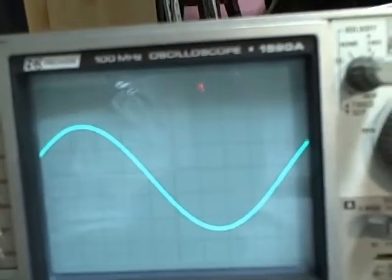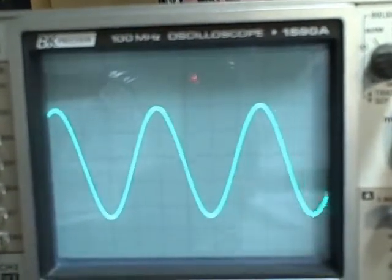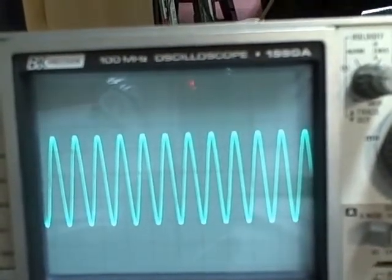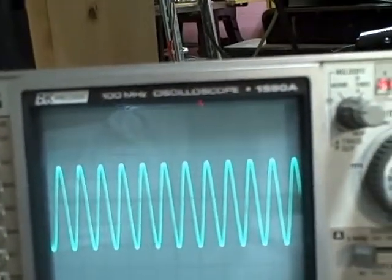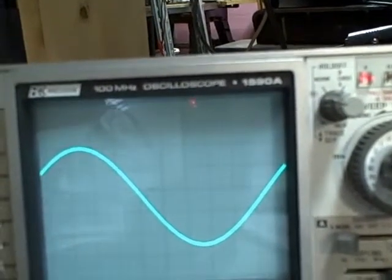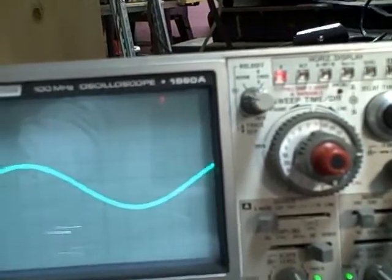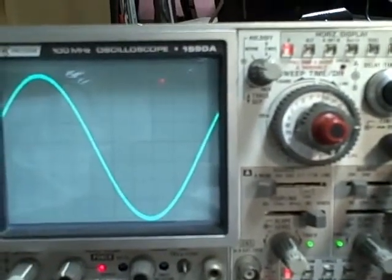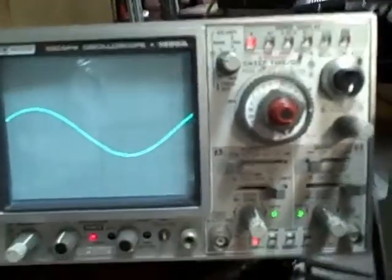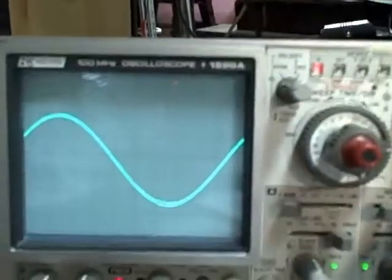We are on times 10,000, so now we're running from 100 kilohertz and increasing the frequency. There's 500,000 — that's halfway. There's a million. There's 1,108,000. We've gone through the entire set of ranges and all frequencies using sine waves. I was on minus 10 dB; I could have been on maximum or minimum. With the dB switch on, we can increase the sensitivity, and you can see the waveform pick up a little more noise as the noise becomes as strong as the signal.